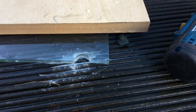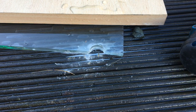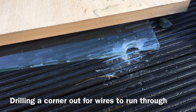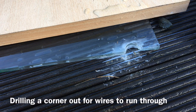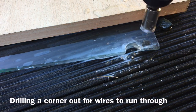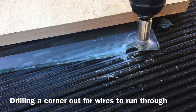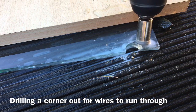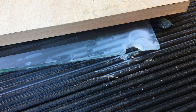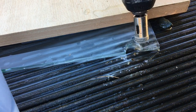My phone ran out of battery halfway through, so I'll set it up now. We're going to put on safety goggles and gloves and drill. I'm going to run the drill on the side of the glass to get a bite — I thought it would crack but that isn't the case. I'm just going to run a bit of water on it first and then start on the side to get some purchase. You can see there's a slight bite here after rinsing it with water. We can use that to put the drill straight and drill downwards.